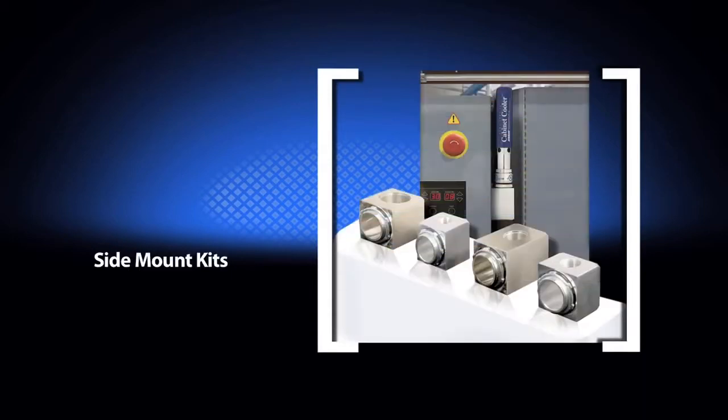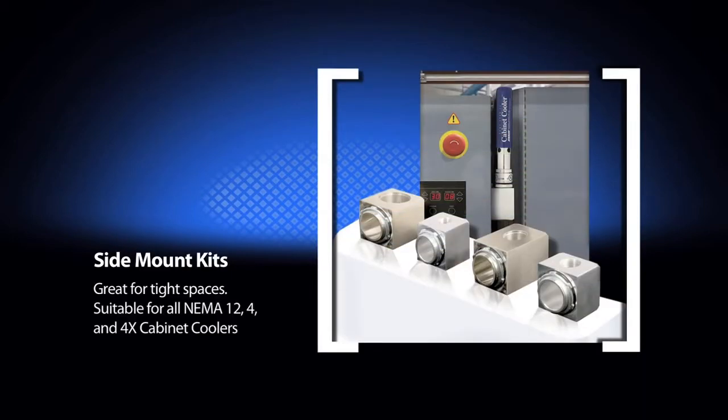Do you need to mount the cabinet cooler in a tight space or on the side of an enclosure? Side mount kits are available for all NEMA 12, 4, and 4X cabinet coolers. Side mount kits for NEMA 12 cabinet coolers have an aluminum construction. Those for NEMA 4 and 4X are Type 303 stainless steel.